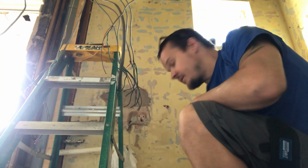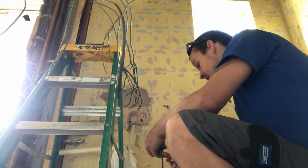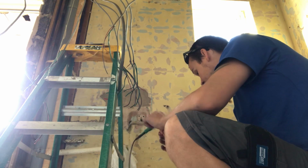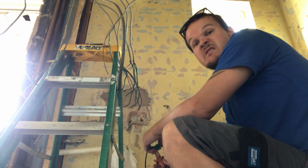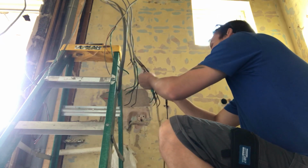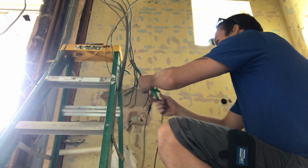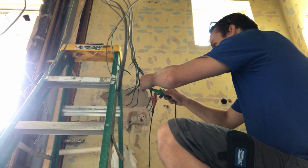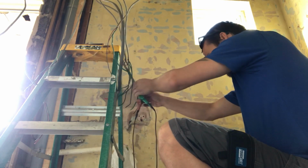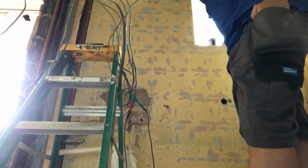Right, so I'm just starting to test these end-to-ends with my meter. So I'm just nulling my meter. 0.00, which is good. And then I've got my legs here, which are still marked up 2 and 2. So let's see if we've got a ring. It's good. So what I'm going to do, rather than mess about with the iPad at the minute, is I have got...